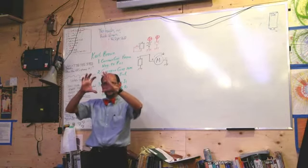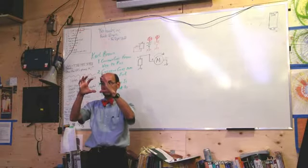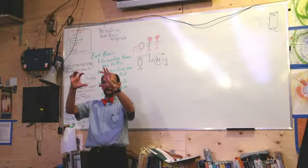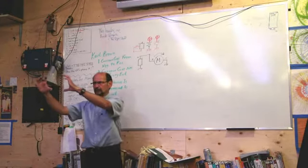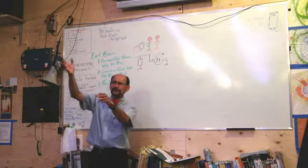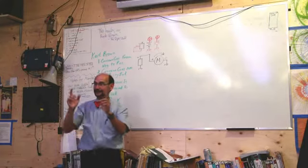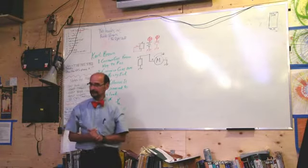What we do is have an automatic switch called a commutator — basically two plates. The brushes are connected to positive and negative through friction on those plates. When you turn the power on, you get north on the armature; it creates a magnetic field, is unhappy next to the north magnet, and runs away. When it does that, it turns around, the plates turn with it, and now the plate connected to positive is now connected to negative. It keeps being unhappy and spins around and around.